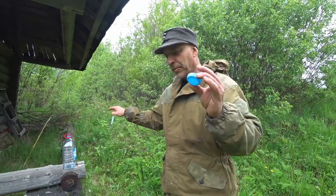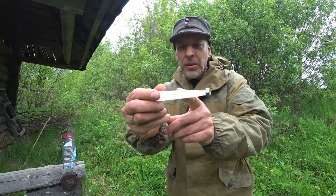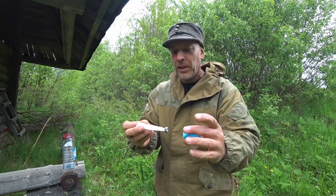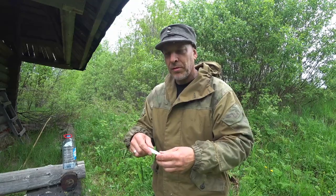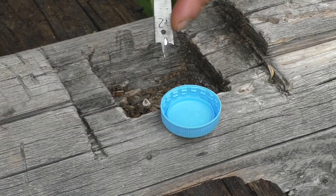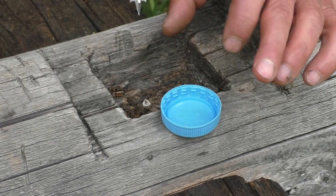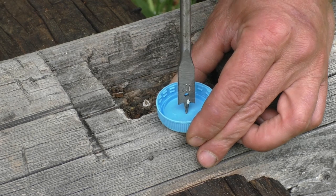The first thing we have to do is take the lid from the bottle and then take this little nozzle. You can see it's tapered up to a point. We want to drill a hole in this cap — in this case about 12 millimeters. It is best to use a drill of this type here, not an ordinary spiral drill, because with a spiral drill you might end up with a kind of triangular hole.